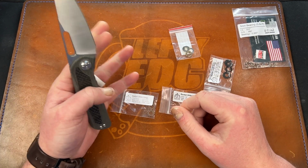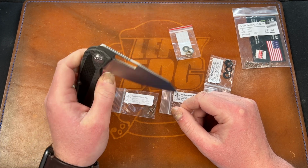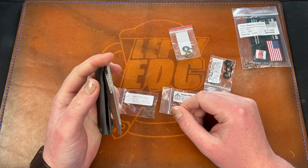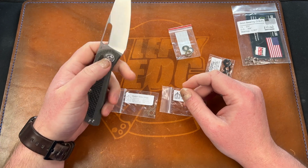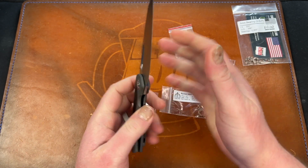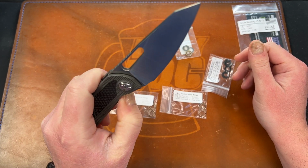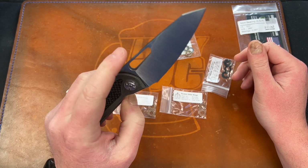So when I took this apart, I was like, hey, maybe the 6mm are what fit in here, right? Because it's Chinese made. We've been putting 1/4 inch in everything, but maybe it's really 6mm and the 1/4 inches just fit because they're slightly larger, right? So I put them in and I Loctited it, and I had absolutely no play, and it was great action, very smooth. I'm not feeling anything, right? No resistance, none of that bearing shit. Just very smooth all the way around.